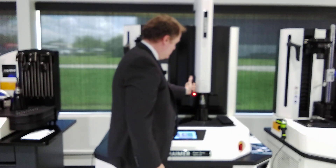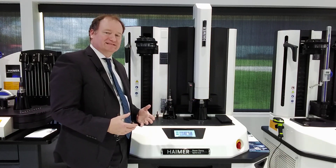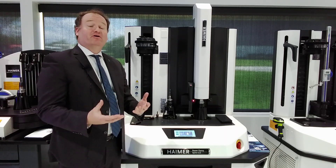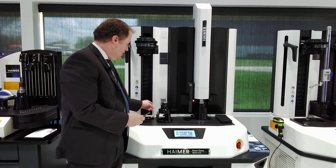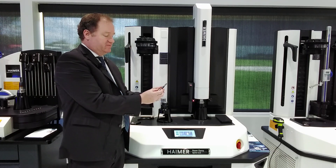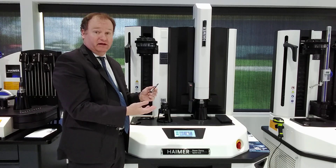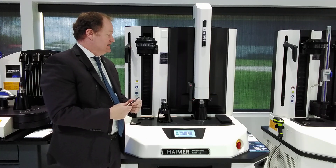We bring this down. Pushing this button will start the actual cooling process. It's a cooling process that utilizes air and an air-oil mist to gently cool this tool. Why this method? Because our preferred method — using cooling bodies — is not practical when used with a shrink fit ER collet. We offer a shrink fit ER collet that's flat bottom with nowhere to put a cooling body, or a version with an extension. This is a very nice method of cooling down odd-shaped things such as a shrink fit ER collet, or a tool with an odd geometry to the nose.